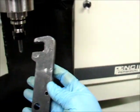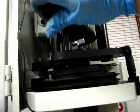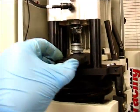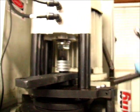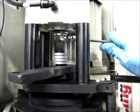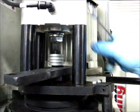The fork — that's the old drawbar locking fork there. Basically I just position the flat so that I can get the drawbar fork on it. Now the drawbar can't spin, and I take my old drawbar wrench, pull this lever down out of the way, and I can get to it well enough here. Notice it's loose — to tighten that up.